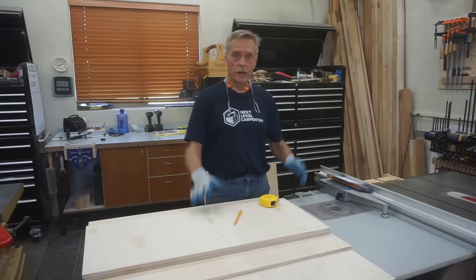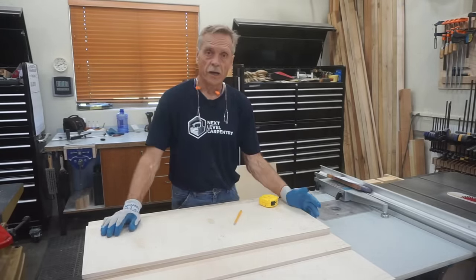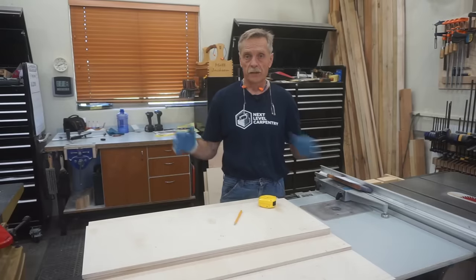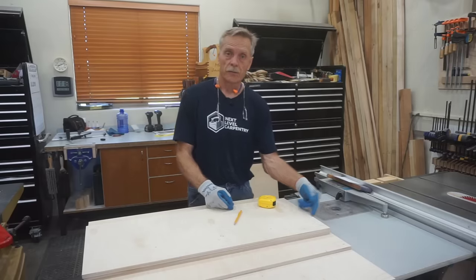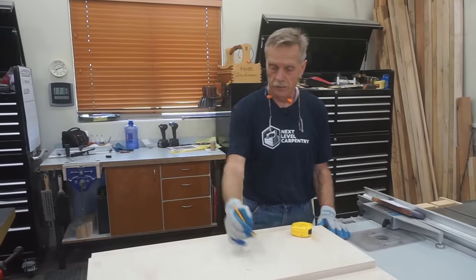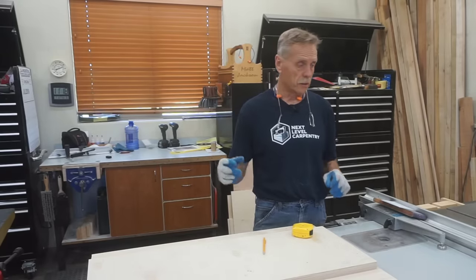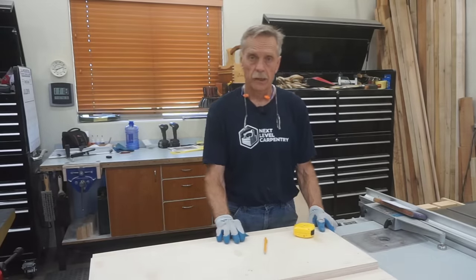And when I'm cutting a large batch of parts like this, I'm always mindful of the edges. This is a cut edge, this is a factory edge. When I cut this, this will be a truer edge than the previous cut one, so I'll turn the pieces around so they index against the fence for the final cut, and I'll make sure I don't flip these pieces so that I end up indexing off a rough factory edge, but a nice cut on this side. And plenty of times I mark these things for a good cut or whatever, so I can keep it all organized, because if you get one of these pieces flipped around and you go through the same sequence, you're going to have one part that doesn't line up with anything else, and that's a pain to deal with.